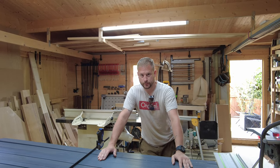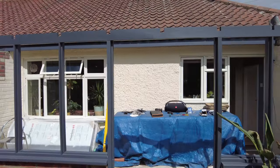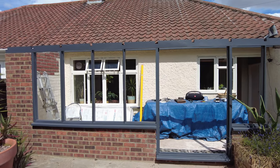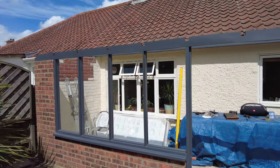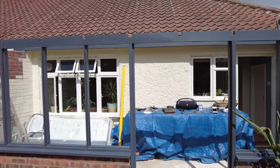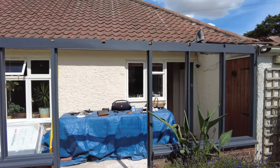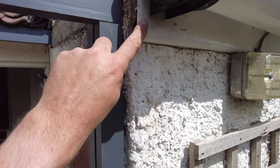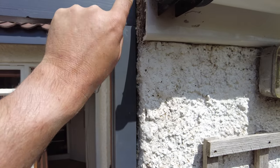At the moment the beam is quite flexible because it hasn't got any rafters in. We've also got the door frame in this morning. Unfortunately, when you're pulling down an original building to put our building on, there's always going to be problems. On this side it's 40mm deeper than the other side. We've got to run the rafters gradually longer and longer — 40mm difference across 11 rafters — until we hit 40mm at the other end. We also need to tie in this fascia with our fascia coming across, keeping the rafters long for that reason.